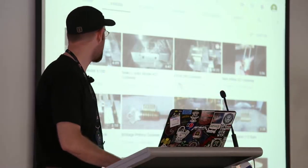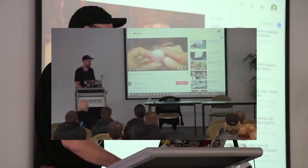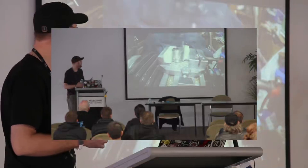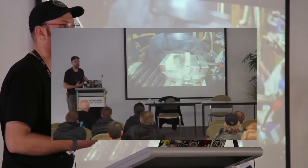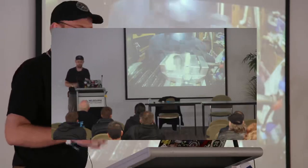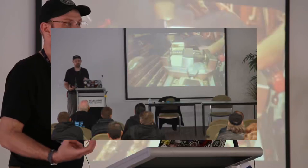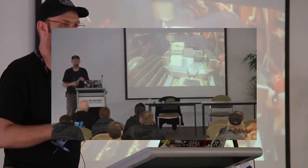Here's a Keymark mortise cylinder I did for Jeff on keypicking.com. This is a full mortise cylinder cut with a boring bar in a boring head. It's sped up really quickly because to do this it took me two and a half hours — you're cutting almost a quarter of a mil at a time, shaving down. To do more than that with the Keymark cylinder, because it's made of a stronger material, I was breaking boring bars — and that's more expensive than breaking end mills.